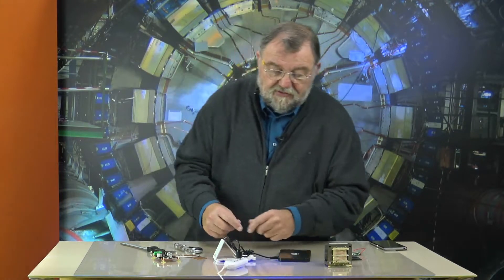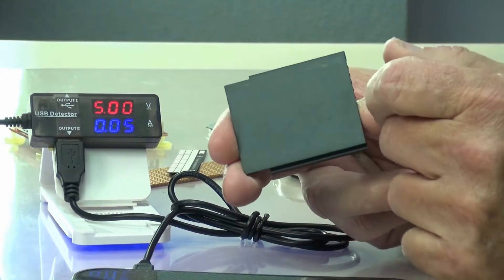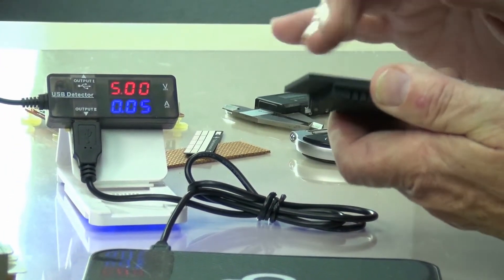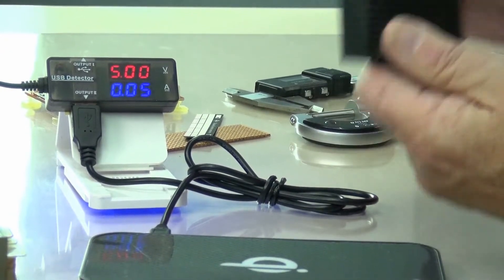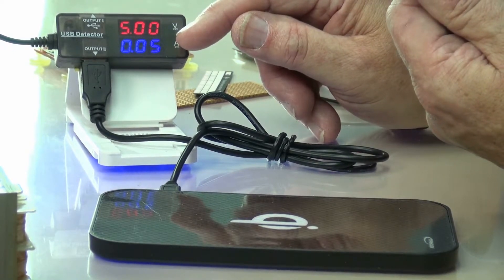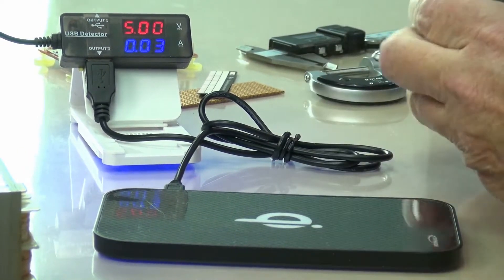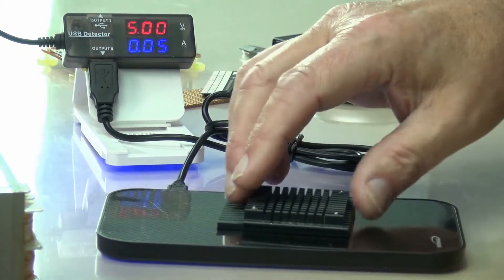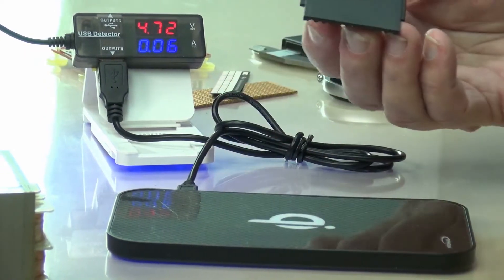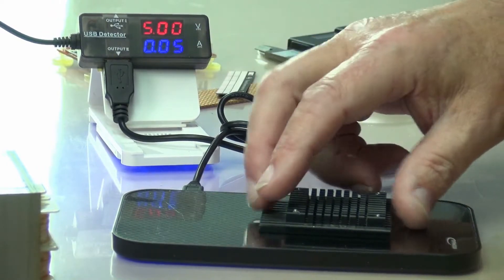I have done a small trial. I have here a cooling body out of an old computer. This cooling body has no wires or coil — just a piece of metal. When I lay it onto the loading device and have a look at this small USB measuring device, you can see in the blue area how the electricity flows. This loading device always takes electricity to itself even when nothing is on it. Now I put it on and you can see electricity goes up to show the effect — power is taken because inside this cooling body eddy currents are made.